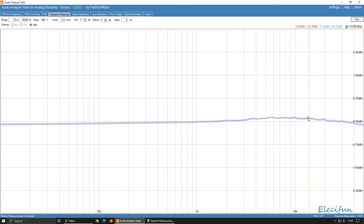It is actually suggested to use the wiring system straight in rather than the scope probe. On the high frequencies we seem to go up a little bit, but even at the very peak that's only about 0.12 dBr above the reference voltage going in — really nothing to say there. It's not really going to make any difference you'd notice. There's about 20 and a half dB gain there, which from what I understand for pre-amplifiers is quite a lot.